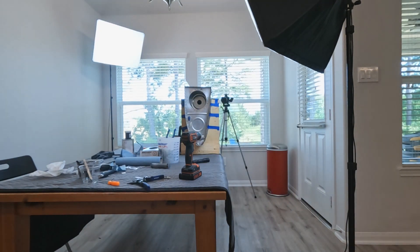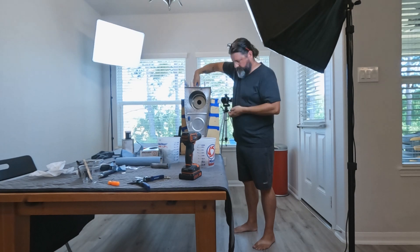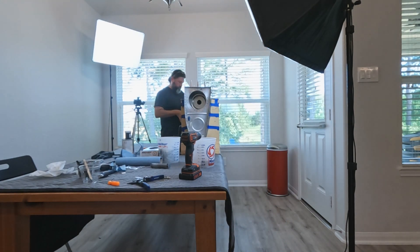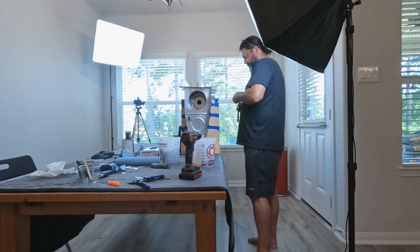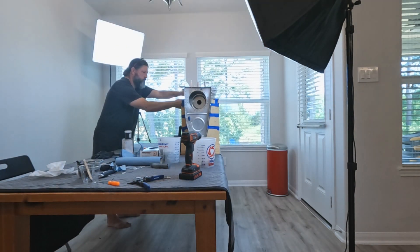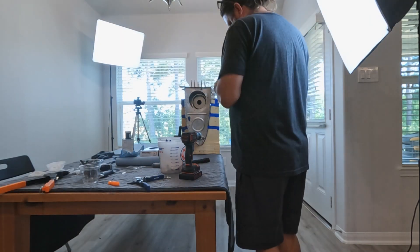Dropping the baffle in is a pretty simple process, then trying to get a bunch of clicos in there to hold it tight and get that sealant where it needs to be. It's still a lengthy process — I think it took about an hour from the time I started mixing the sealant until I started putting clicos in. That was an hour of mixing sealant, loading it into syringes, and applying it to the tank skins.